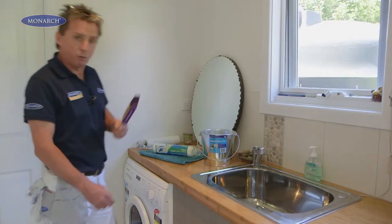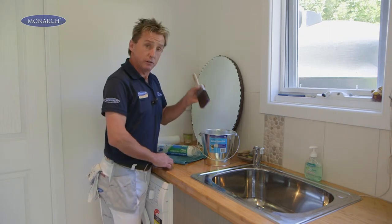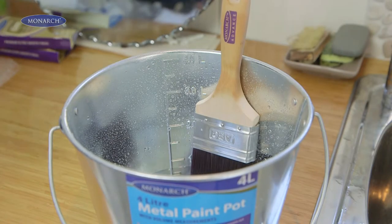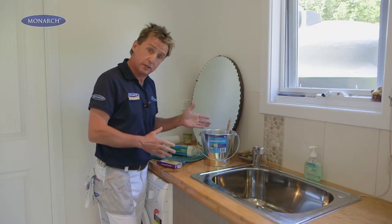Here's a painter's tip. Before you start, you want to lubricate your brush to help it work properly. If we're using water-based paint, we soak our brush in an inch of water for about 15 minutes. If you were using oil-based paint, you would soak it in turps.